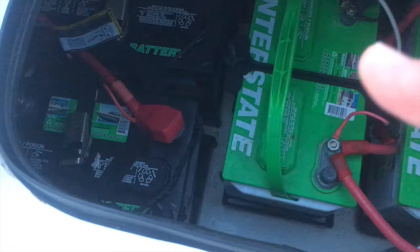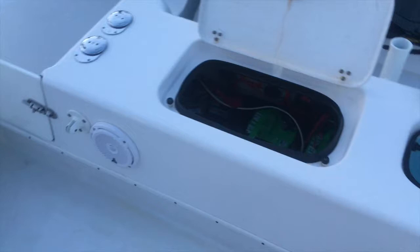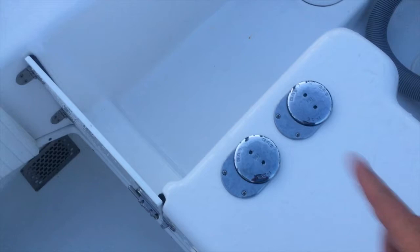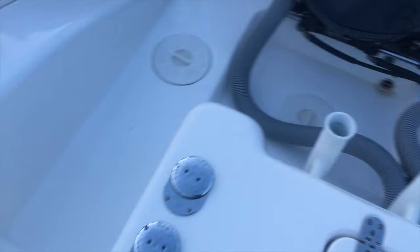This hatch covers the batteries. The boat comes with four batteries — two Interstate house batteries and one battery per motor. There's also a device that takes power from the motors and distributes it to the two house batteries. You'll also see fuel filters in there. This electronics box is very accessible — since we do a lot of deep dropping, you can walk over, open it up, and plug directly into one of the green Interstate batteries. There are two gas tanks totaling 290 gallons — 145 gallons each.